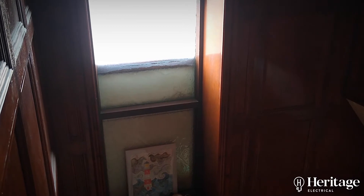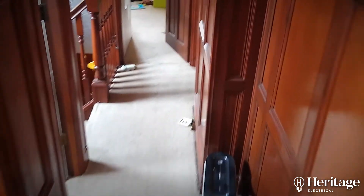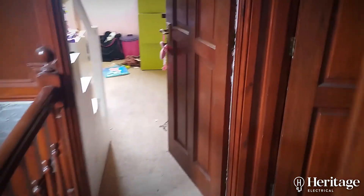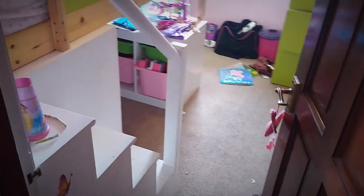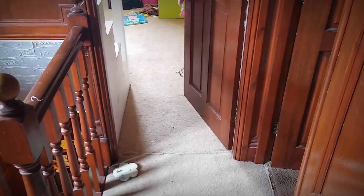Just on the other side of this window is where the garage is located. For minimal intrusion we just rolled back the carpet in the hallway, took up a floorboard all the way down into one of the young one's bedrooms and rodded across. We were able to pick up every light — the living room underneath, the spare room/study, all the kitchen lights, and the dining room — just by taking up one long floorboard and drilling into the floor void to poke all our cables through into the garage.